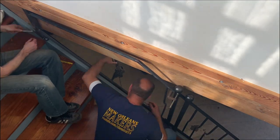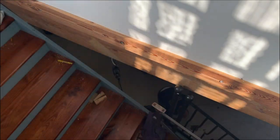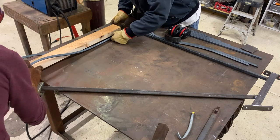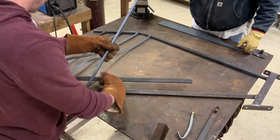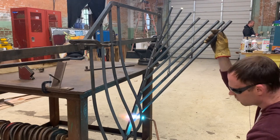The last section is going to be a little bit different because it needs to fit into a diminishing space as the stair stringer intersects with the beam that forms the opening to the second floor. After the first few balusters, I'm going to start bending smaller and smaller curves to fit the space. I'm going to just freehand these and sort of eyeball the geometry I need.